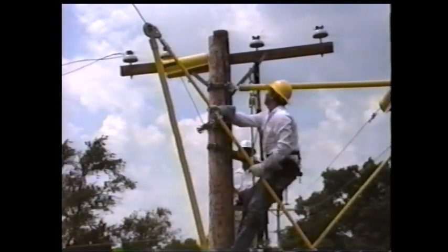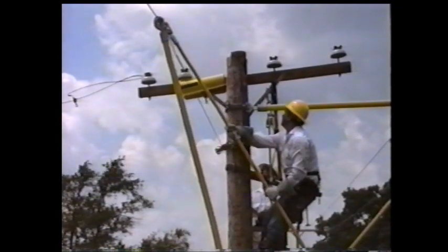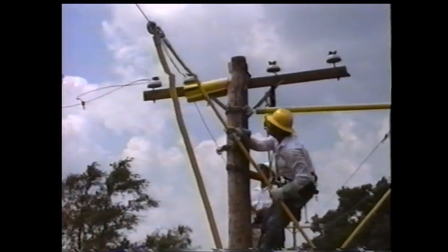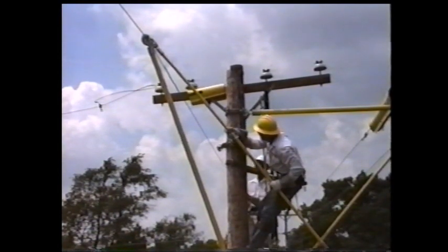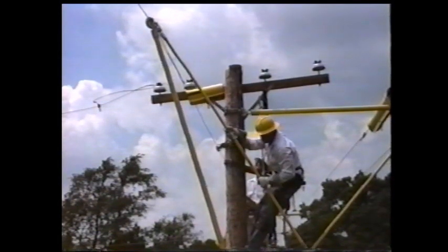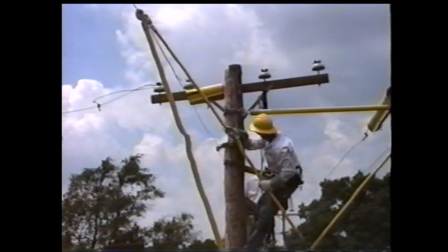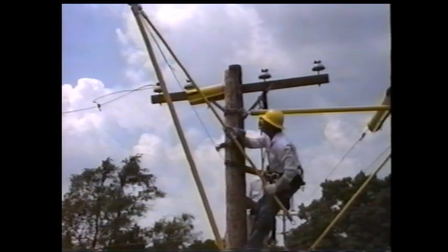After the conductor is untied, the ground personnel will again pull on the blocks that are rigged to the 2.5-inch by 14-foot wire tongs. When proper lift is achieved, push the 1.5-inch by 10-foot wire tong out until clearance is made for doing whatever task is required. Once clearance is met, tighten down on both wing nuts on the pole clamps to secure the phase.